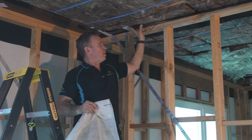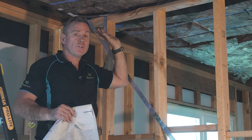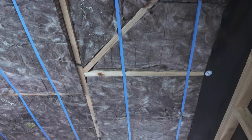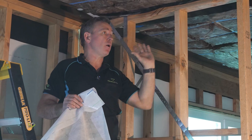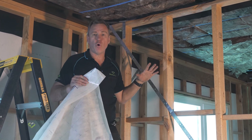This is an internal wall but the top plate doesn't go all the way up underneath the trusses — there are L brackets that sit from the truss to the top of the top plate to hold the wall. The easiest solution was to put a tight bridge across the top of all these internal walls, making each room its own perimeter. We've meticulously sealed the tight bridge to the brackets and we've got good integrity, simplifying the process so we can section off room by room rather than trying to do the whole floor in one piece.